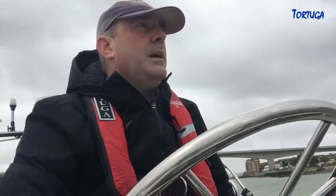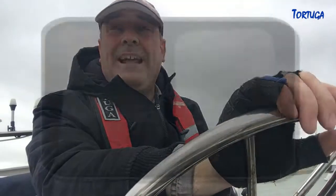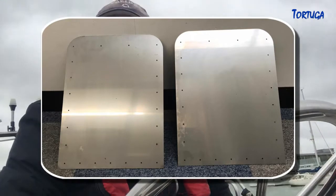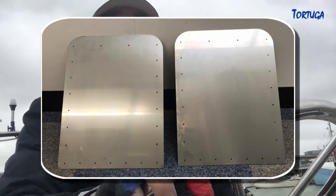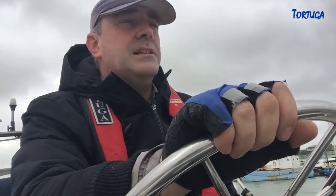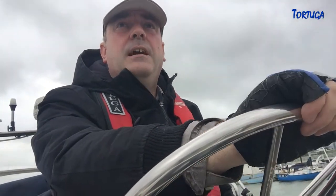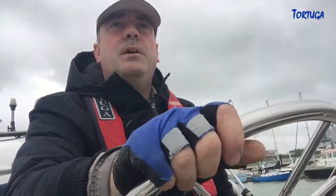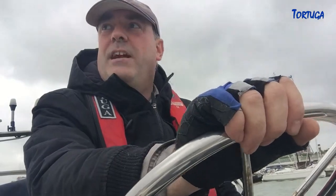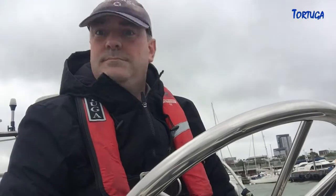So we're going to be replacing these with a set of stainless steel flat trim tabs — they've got no downward angle at all and can present a completely flat surface. They're also slightly bigger, extended. What this means is that you can push them down at a lesser angle, but because you've got a bigger surface, it actually has a greater effect. Therefore, better effect, less drag. So that's how it's going to go — we'll have to see how it pans out.